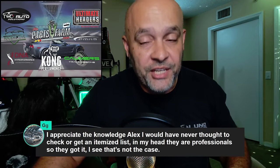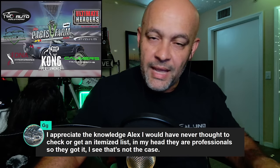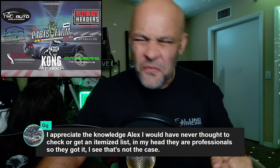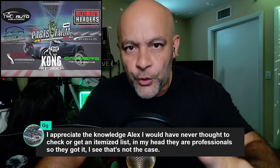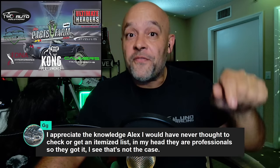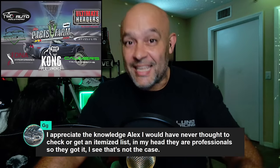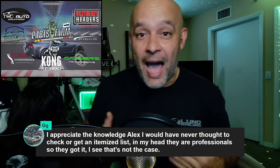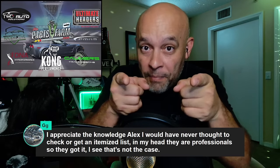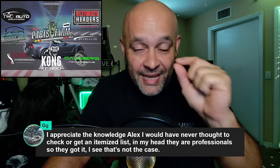I'm gonna be honest with you, GG. Not one engine builder is as professional as Ford. And I am not saying that because engine builders suck. You could be listening to my show right now and you go, fuck you, Alex, you don't know what you're talking about. You are not as good on the processes as Ford is. That's why Ford engines have a 30,000 mile warranty. There is a process, even though it's stamped and ka-chunk-ka-chunked out. I trust a stock motor up to 1,000 horsepower if it's studded more than your built motor, because the processes to get everything built are super dialed in by Ford.